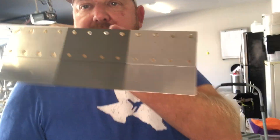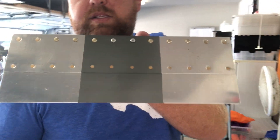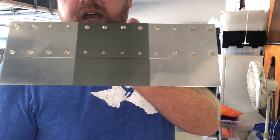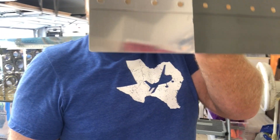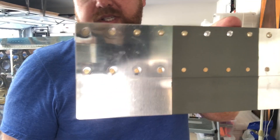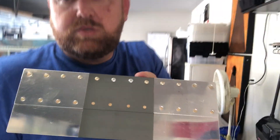So I'm doing this test. I took a practice kit and put a bunch of different types of aluminum rivets in it. I self-etching primed the middle — prepped it properly: cleaned it, scuffed it, cleaned it, scuffed it, cleaned it, then self-etching primed it. One side has WD-40 rubbed all over it in about two coats to simulate Corrosion X. The other side had nothing — I just wiped it with a paper towel, and it's been outside for four months.